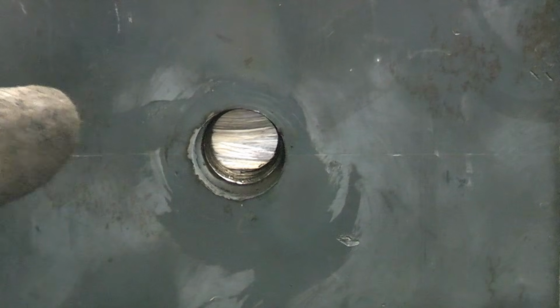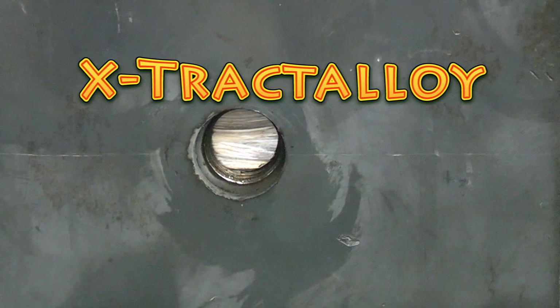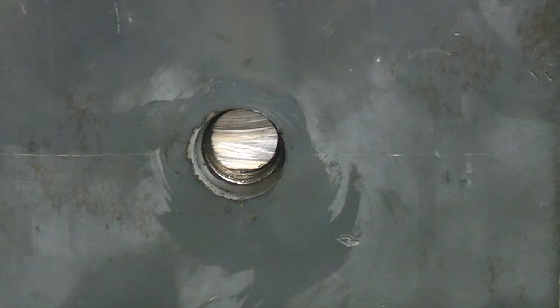If you ever get a bolt that's sheared off inside of a hole like that, you can actually still use a welder. You can get a special electrode called an extractor alloy, and they are specially designed to be used in situations like that. You get the rod, push it in there, and the special flux coating will prevent it from sticking to the sides. I haven't actually used one, but I have seen them, and they are supposed to work pretty well.